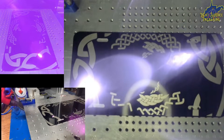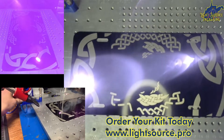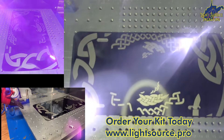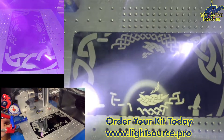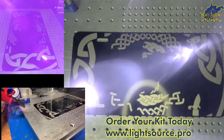Here is the air assist on. Now I'm going to turn it off and we'll watch the difference — we'll see the amount of smoke that rises up above our fume extraction hood and makes it into the room. Then we will turn the air assist back on and the air assist will direct that smoke right towards the fume extraction vent, so we can suck all that smoke out of the room and save our lungs.